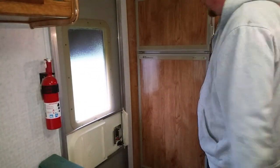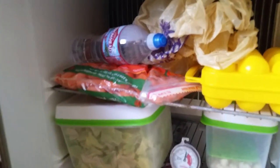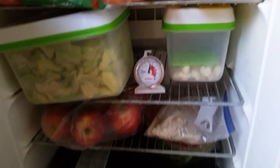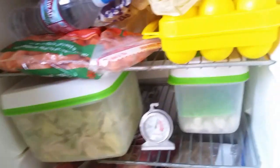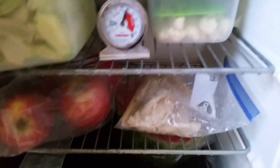Now on to the fridge. One thing I've noticed about keeping our Dometic refrigerator cool is that it's good to have it loaded — full of product. It's not packed in there, just loaded. Sometimes when you try to check the temperature and it's empty before you go, you can't get it down to temp. So put your food in it, fill that space up with stuff, and it'll come around a lot better. If you just have an empty fridge and you keep looking at the temperature, you're going to find it's struggling.